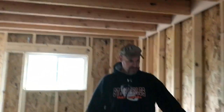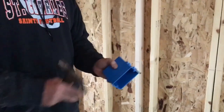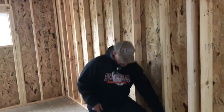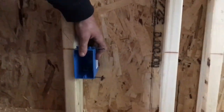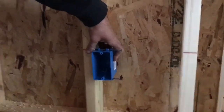We've drilled holes through the studs and marked where we want our boxes. We'll be putting car siding on, so we need to hold the box out the width of the car siding — three-quarters of an inch — so that when the car siding goes on, the face plates are flush with it. These boxes simply come on: you mark them where you want them and then pound the nails in.